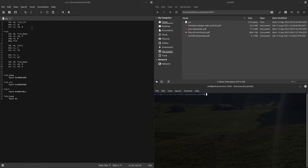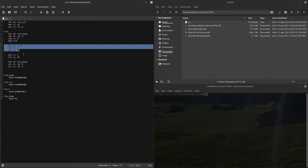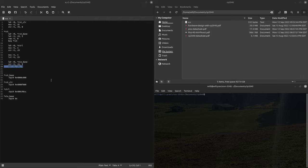So let's recap our steps. We release the GPIO from reset, we check that the reset is done, we set the control register to assign the pin to SIO, we enable the output, and then we set the output. I guess it's actually 5 steps.